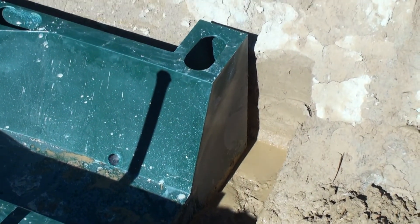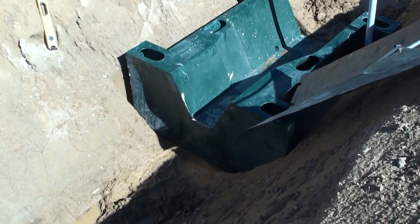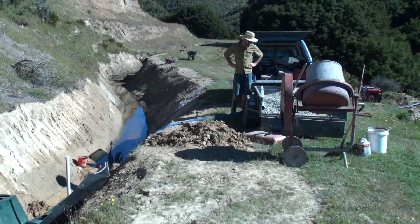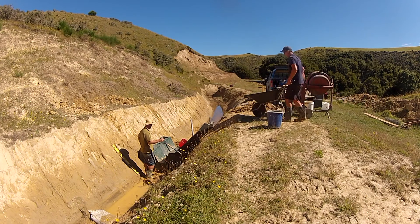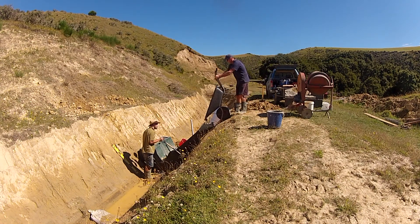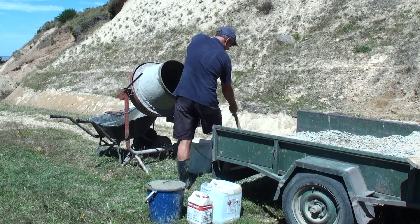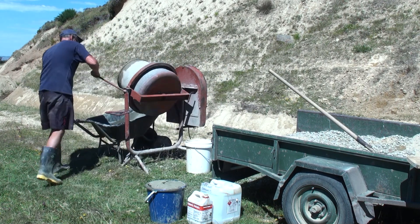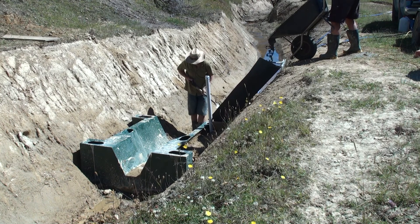These footings were filled with concrete right round each side of the plastic, so it's well bedded in at both ends. We also filled the holes with concrete — about a third fill of the whole plastic flume itself — to weigh it down. If you had access for a concrete truck you could do this a lot quicker than mixing by hand. One advantage of filling slowly is that you minimise any bulging that could occur in the plastic, and it seems to handle it pretty well.